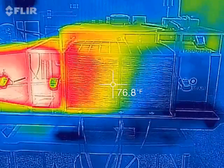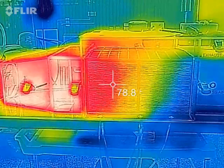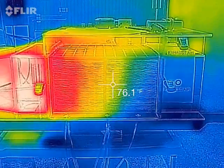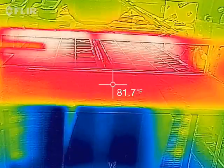You can see the hot, dry air comes in the HMX. This is the side exhaust port, so humidification is happening perpendicular to the process air, and it comes out the top.